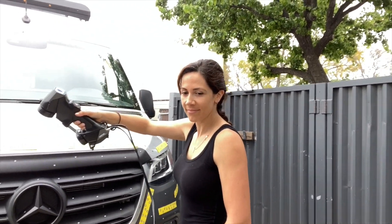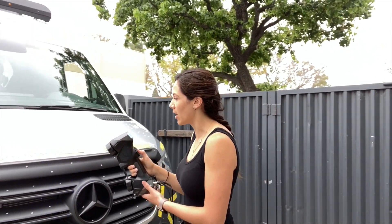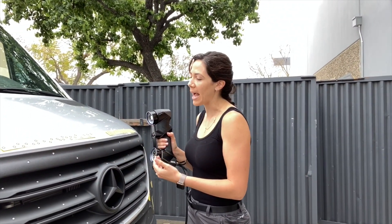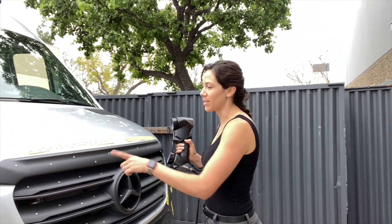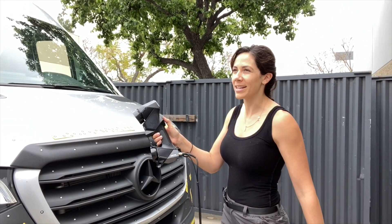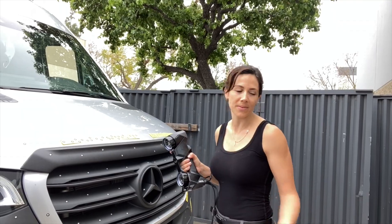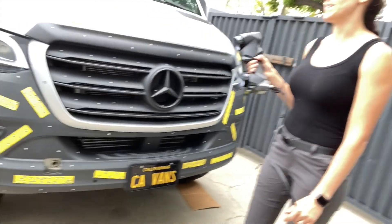So what do all these things do and how does this work? What they are is they're targets. Once the scanner sends a laser to the target, it reflects back to the scanner and it puts a position in space. So as long as those targets don't move, it always knows where it's at. I can turn it on, stop, turn it on again, and it always knows where it goes — it just begins to create a map into the computer. Without the targets it doesn't really have anything to read off on.